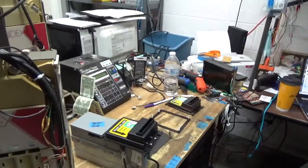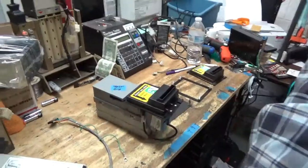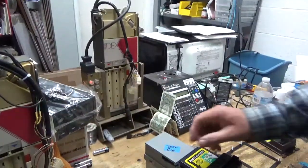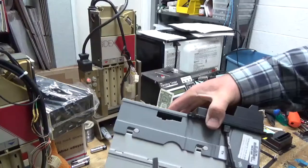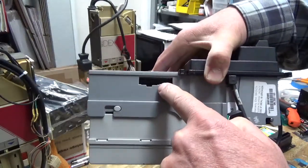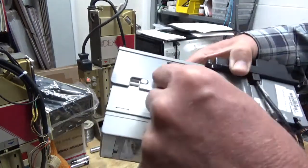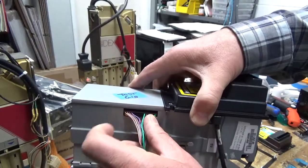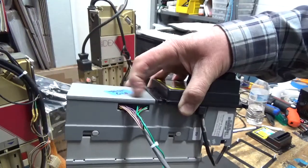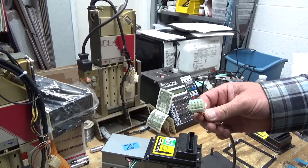Without further ado, let's set this conversion up and I'll show you how easy it is to make it plug-and-play. I'm going to set this mech aside because I have one on my test jig that already has nickels and dimes in it and is already plugged in. See those two little white pins — holding it this way, they go to the right because there are a couple blank spaces on the pins. Do not force the plug — it'll fit in. Go the last eighth inch gently. Do not force it or you'll bend those pins and you'll be stuck having to repair them.